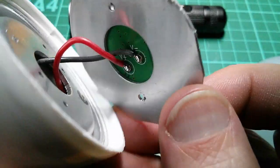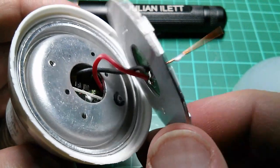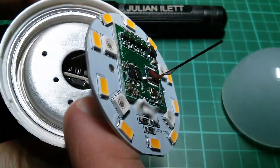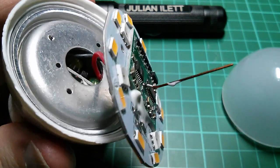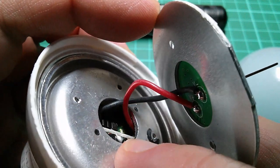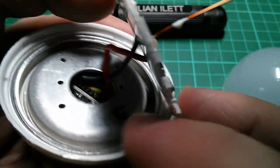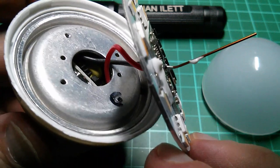This printed circuit board is a metallised aluminium PCB, with DC coming in on red and black. The board is screwed down to a substantial aluminium heatsink - this part of the lamp gets quite warm whereas the plastic dome doesn't get warm at all. Inside there's some sort of switching regulator. I can see an electrolytic capacitor of 330 microfarads and the yellow covering of what looks like a transformer, so I'm guessing this is galvanically isolated. It doesn't matter much because the whole thing is plastic - you can't get your fingers onto any metal parts.